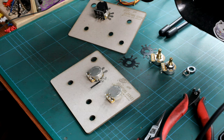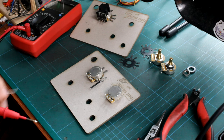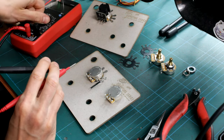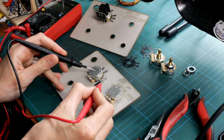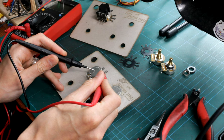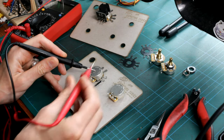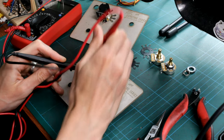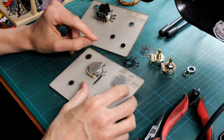I'll just display the efficiency of the continuity through here before I forget. I'll just place one of the probes on the casing and then onto the lug. As you can see, nice continuity right the way around throughout, so we know that any of those lugs are perfect to use for any ground connection.